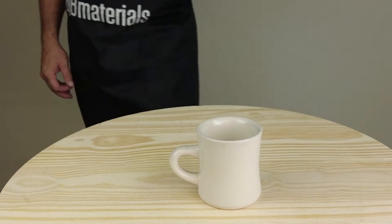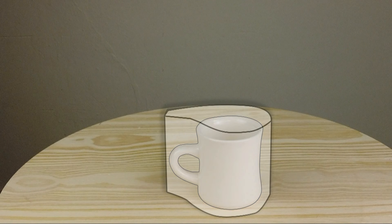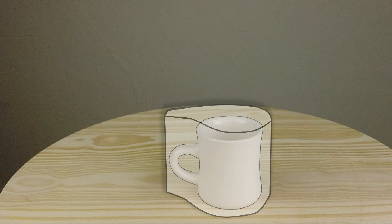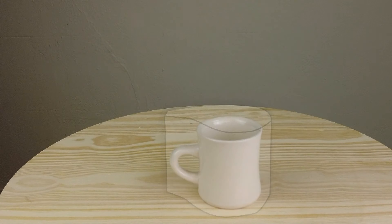Once we have a rough idea of that, we need to visualize how we're going to build this mold. This is a good mental process of taking an item and thinking through all of the steps. This is going to be a poured mold, and we're going to make this kind of a teardrop shape. We want to keep those mold walls very thin — about a half inch thick — because we're going to be making this with very soft, stretchy silicone. Then we're going to be cutting through; it needs to be soft enough that we can pull that back and cut through that little handle area. That allows us to have only one seam on the inside of the handle. This is one of those videos you have to watch through once just for that to make sense, and then watch it again.